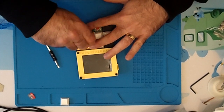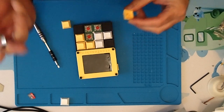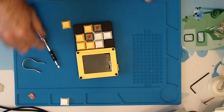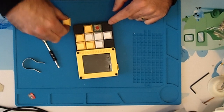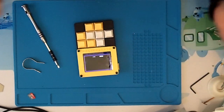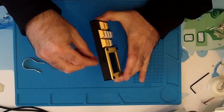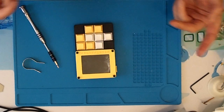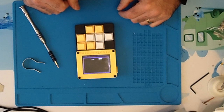Put the remainder of the keycaps carefully on. Make sure you get them in the right spot. If you have to take them off, do it carefully with a key puller, because the stems can snap if you're not careful. Push them on — they need a little bit of force — and then voilà, you're good to go. Only at the very end, put in the SD card, because the SD card will stop the board coming out if you need to remove it.